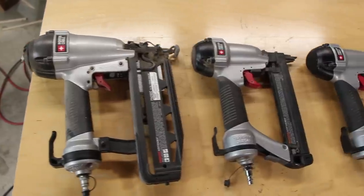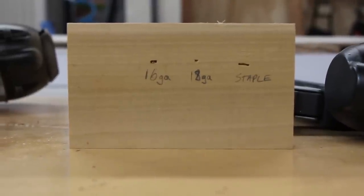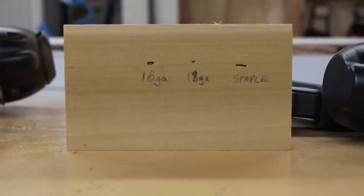The next one I want to talk about is the pneumatic crown stapler. I got this early on in my woodworking career as part of a kit with other pneumatic nail guns. When I tried it out, I put a couple staples in to see what it looked like and I quickly realized that I did not want to use this, mainly because the hole that this leaves is a slot. It's big. With a nail gun, you have just the single nail, so that's kind of a deal breaker because I don't want to have a huge hole to fill that's twice as wide as a nail or more.